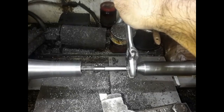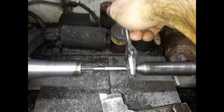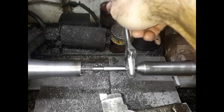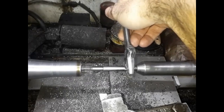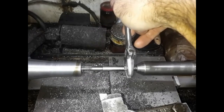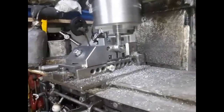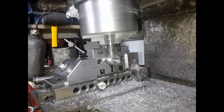The rear end was then drilled and tapped for a drawbar. Finally, a flat which shall engage with the mill spindle and the internal keyway is cut.